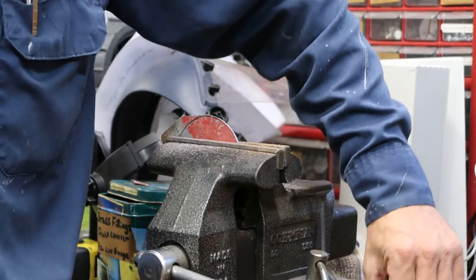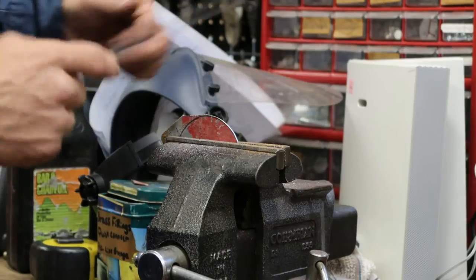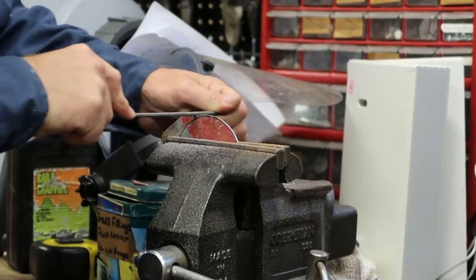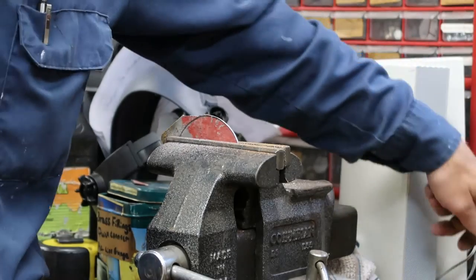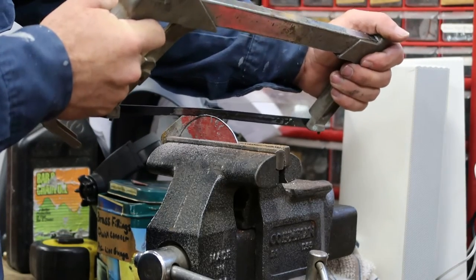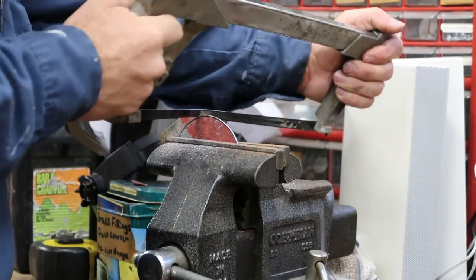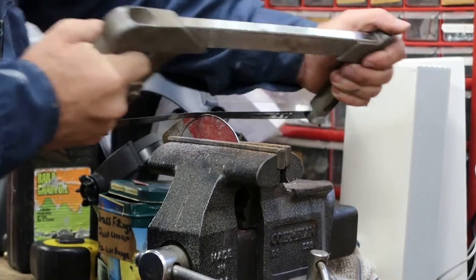This is where the little rat tail slash chainsaw file comes in handy. If it's hard to start, just make yourself a little divot — it makes it a whole lot easier to get the saw to start in the direction you want it to go. A little shallow is one thing, a little deep is too much. If the angle's off you'll cut in beyond the line, and you need to start right there.